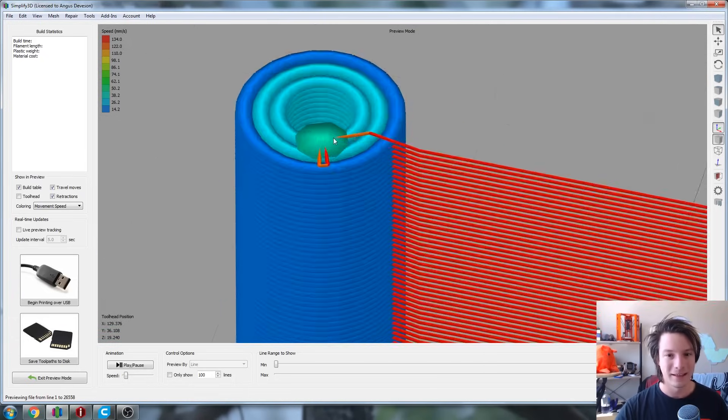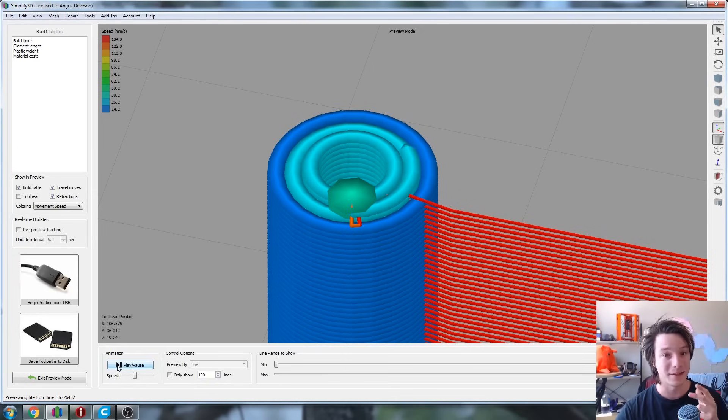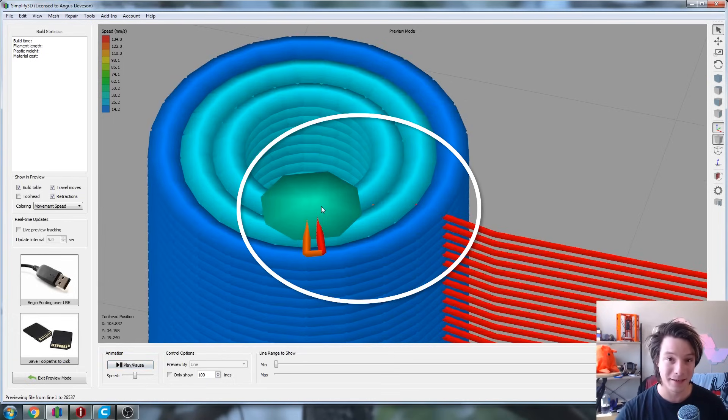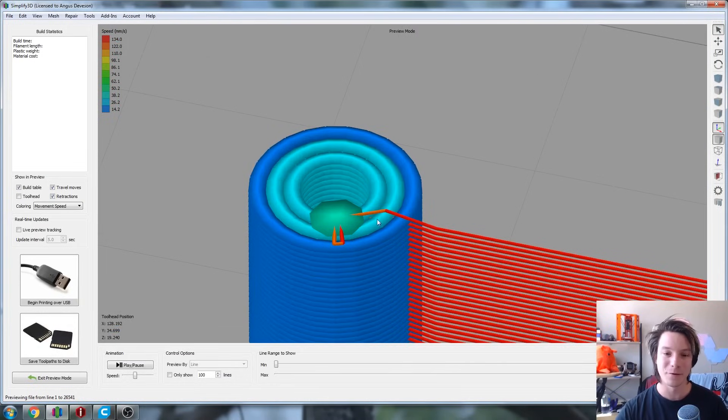I'll look very closely here. I'm going to zoom in as much as I can. So let's preview it by line. This is each line in the G-code that is being 3D printed. And if we watch it slowly, you can see that it comes in and starts extruding on the innermost perimeter. Then it moves out one to the middle perimeter. This is a three perimeter file setting. And then it comes out to the outer perimeter. But it's this movement, this retract inside the part, and then movement across the surface of the part, which stops the stringing, at least in my informed opinion.